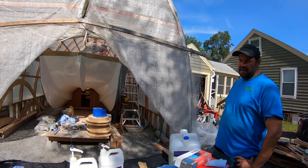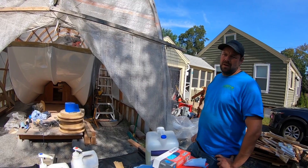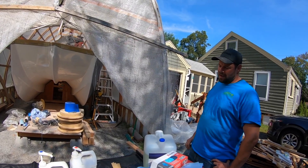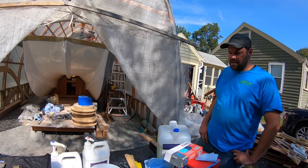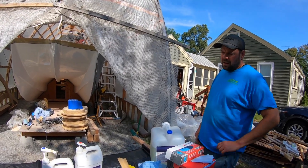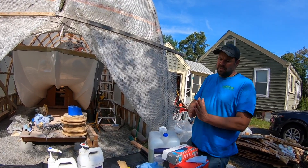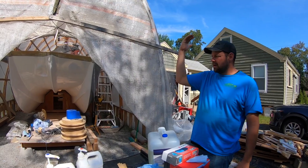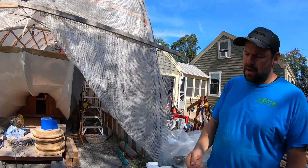It's going to be tough for me to really get video inside there because everything's kind of down in a hole. We'll set up a camera the best we can, but no guarantees on footage. You guys have seen this layer of glass before — basically we're just doing seam tape on the seams. The tape is six inches wide and that's all that's required: one layer all the way down the seam. We'll fill it out with thickened epoxy and glass over it.